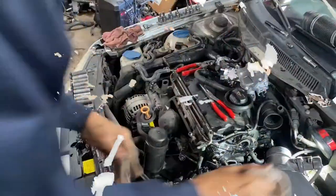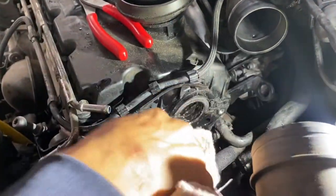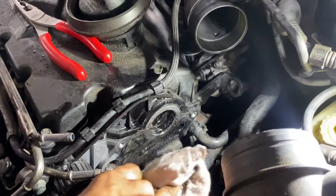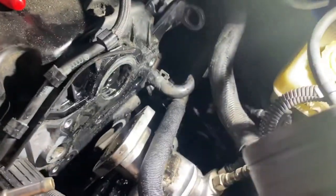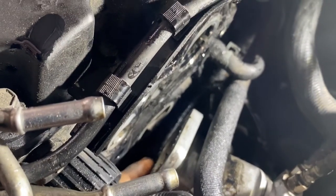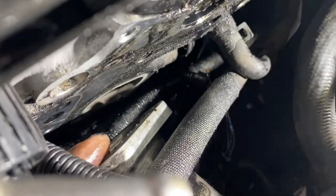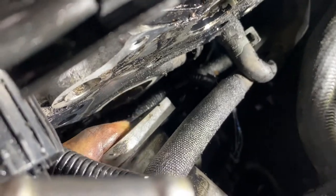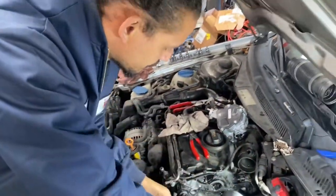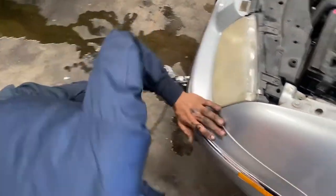I'm inspecting my gasket on my housing — it's in great shape, yes, that makes me happy. I don't have to go out and find one of these. You can take your hand and rub it across the surface: if you feel a hump, that means the gasket is still protruding and it's going to make a good seal. If the rubber has sunken down in the groove, it needs to be replaced. And I just dropped another bolt, so I'm going to retrieve that.